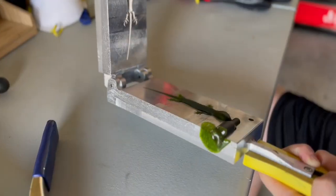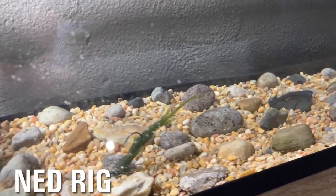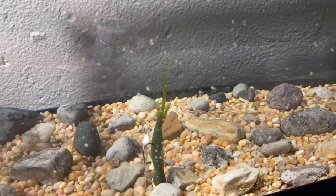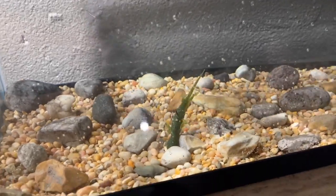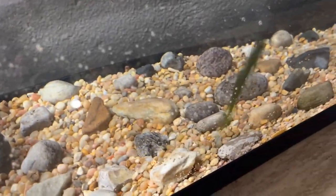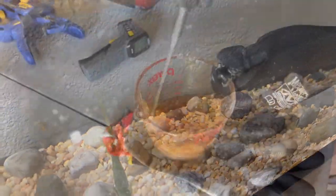There's a little tail flop. As you can see on our tool, we haven't put the vents in yet — venting is very important when you're doing any kind of injection molding, as it helps get all the gas out and helps the part fill properly. Now that we've made some parts, we are testing out a Ned Rig in our fish tank just to see how the lures look in the water — how they float and the tail action and the claws. That looks really good.